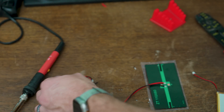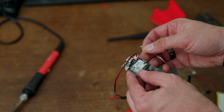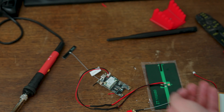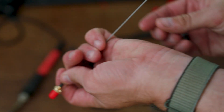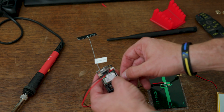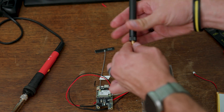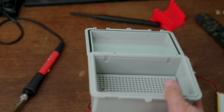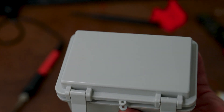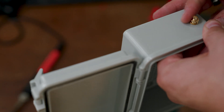If you have charge in your battery, the device will turn on when you connect it, so just be aware. Next, connect the two antennas: the Bluetooth antenna connects to the corner labeled 'BLE' or similar, and the LoRa antenna pigtail connects to the board. Take your enclosure box, measure and drill a hole for the antenna pigtail to pass through, add a nut, and cinch it down tight.